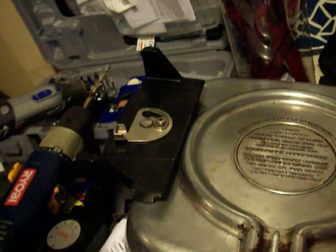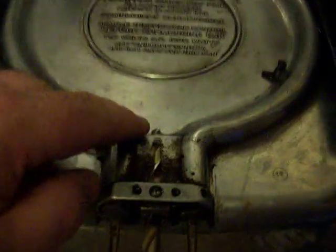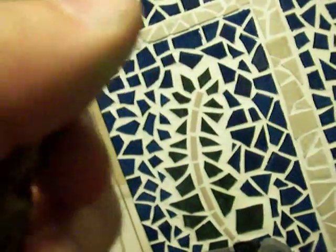Then I went in with another one. The next one I used was five-sixteenths, and that's how I kind of lined it up. Now you want to make sure, if possible, you leave this little extra metal back here — you don't want to be taking all this out. It's just how the casting works on these. And then the last drill — I'll just use my Ryobi here — the final size is 21/64ths. So it was a 21/64ths right here, this is my last hole.